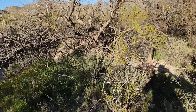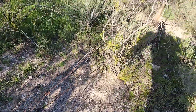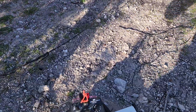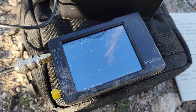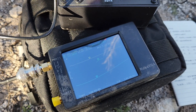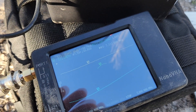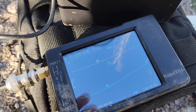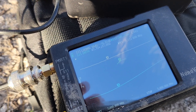Right now I am preparing for my next video, and what I'm trying to do is figure out how to tune a barbed wire fence so we can improvise something in the field. To do that, I have my Nano VNA, and I want to work the 40 meter band, specifically 7.1 megahertz, so that I can work digital. As you can see here on the meter, I have a 1.4 to 1 match, so pretty good.